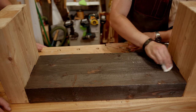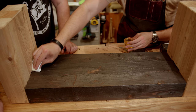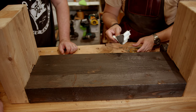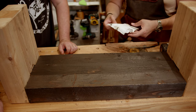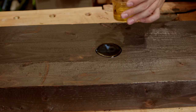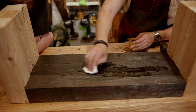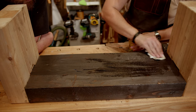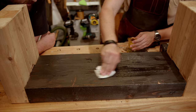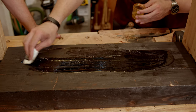One thing that's amazing is that without brushing the surface in any way, there's actually not a lot of color shift as this goes on. You're not getting that same drastic look that you might when you normally add linseed oil to a surface. In fact, the question is: are you getting much linseed oil on there at all? Which indicates that maybe we should just try pouring a little on and spreading it around. We want to keep these applications as thin as possible, but that's dependent on how thin this becomes as the wood soaks it in — and it seems to be soaking it in very readily. Part of that is that you certainly de-moisturized it when you cooked it.